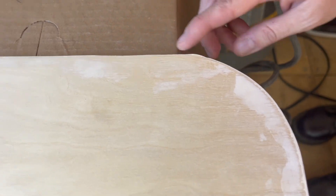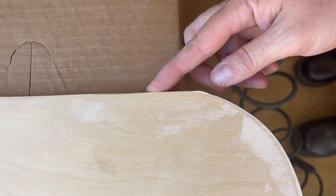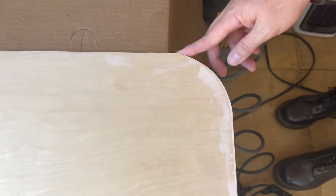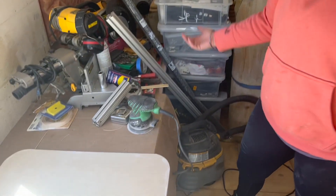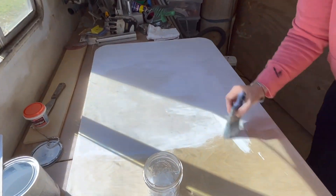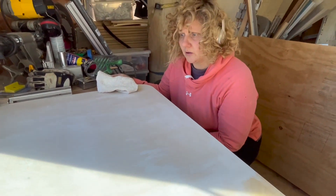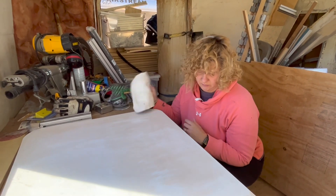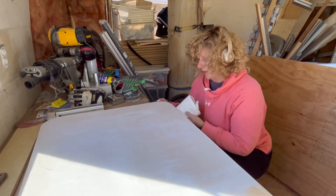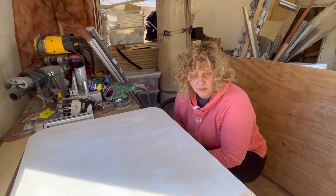Here's something I've learned: the edge banding and filler right there has sort of amplified a flaw where we didn't cut it correctly. Moving forward I'm not going to fix this right now, but for doing Dreamboat's cabinetry I need to be really mindful of how I cut things. It's whitewashing a little bit differently where I put wood filler and putty, but for this project it doesn't really matter because I want it to look like weathered beach wood. That's something to be mindful of moving forward with staining and painting for cabinetry.